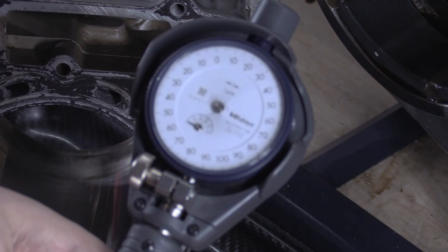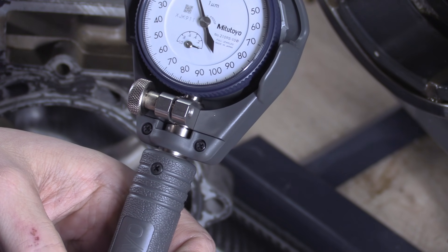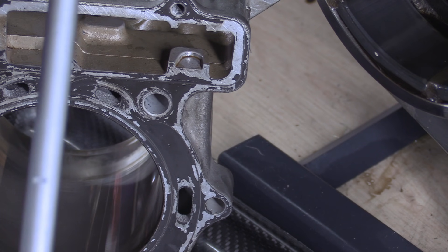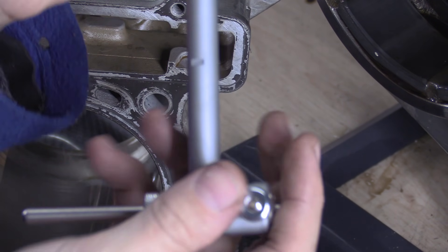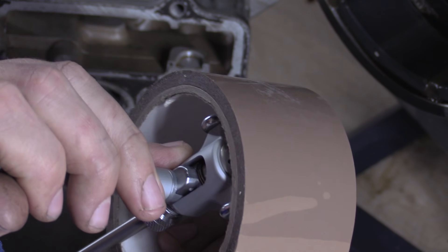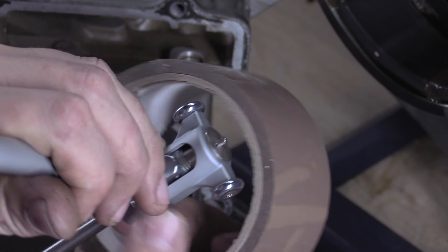When you hit that plunger, that's what gives you a reading. Each increment on there is a micron, so this is really quite sensitive — you can stick a hair in it and it moves quite a lot. On the bottom end you have your two skateboard wheels, and the plunger sits at the bottom. So you have the two skateboard wheels sitting either side, the plunger sits at the bottom, and it's that plunger tip that measures things.